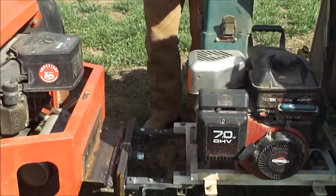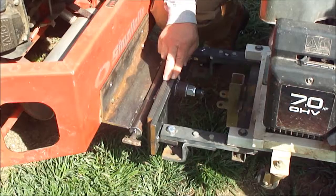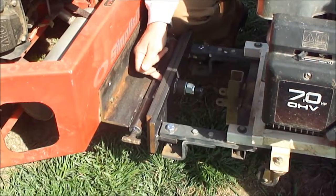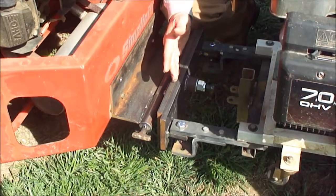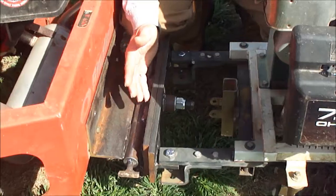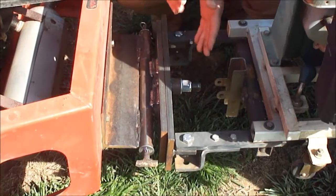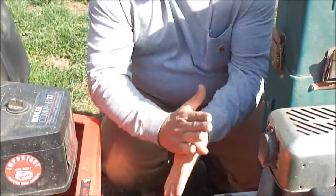So here's what I came up with — maybe you'd be interested in it. We've got two pieces of half-inch plate here, and I understand that may be a little heavy, but we did that to match this half-inch plate here. We've got a three-quarter inch bolt going through it. The reason we chose three-quarter is because sometimes if this is wet or full it's heavy — we didn't know how much strain would be put on that. But with this bolt going through here and these two pieces of plate, it allows this to pivot, so you have an unlimited range of motion this way.